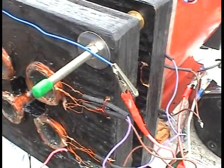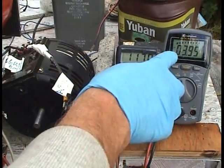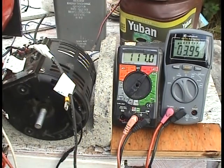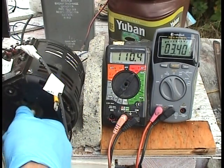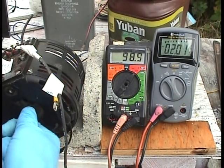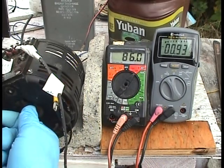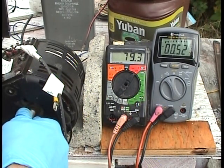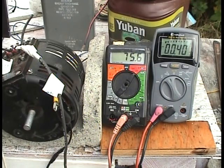Here's the variac, here's the motor — just the motor running off the grid through the variac. Now I'm going to turn down the variac and watch the amps. It's not linear; it's not like you bring it down so many volts and it comes down so many amps. The coils must be saturating at some point. I'm bringing the voltage down to 98-99 — see that? We've already dropped it down to 2 amps. Now all of a sudden it's under 1 amp at 86 volts. If I bring it down to 75 where I had it, it'll be like 0.4 amps — about 32 watts. That's way better than 400 or 500 watts.